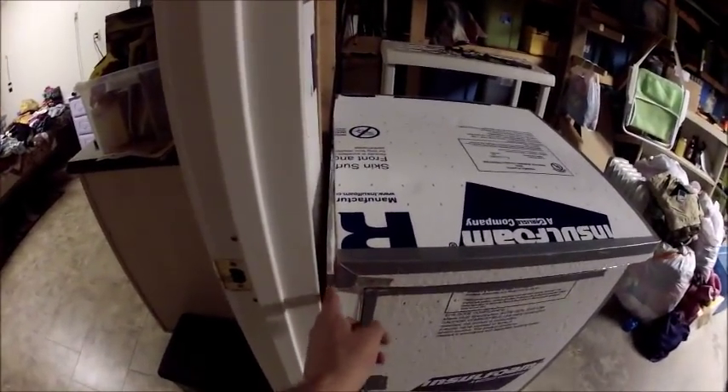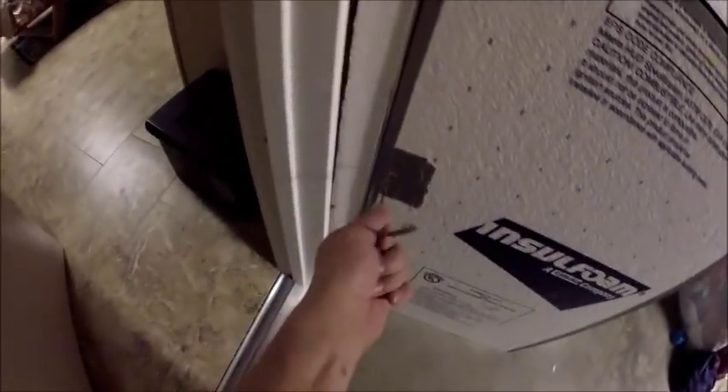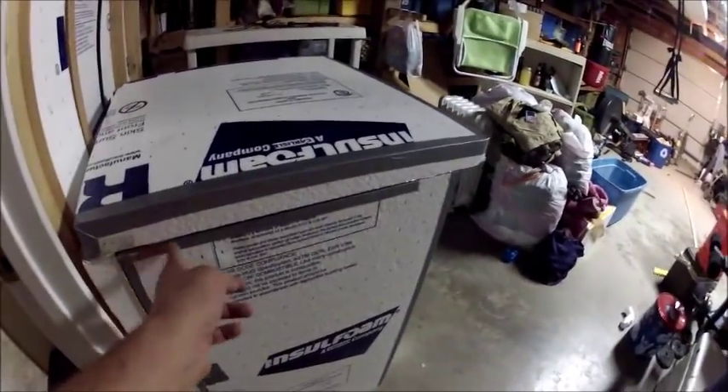Here it is, basically done. I've got two-inch foam all the way around. You can see over here where I mis-measured by a half inch — so measure twice, cut once. That side was 24 and a half in the back and I cut it to 24. It still works and it's still overlapping enough to cover the top, so I'm not worried about it. I took the door and put a rope on it through the old door handle and taped the seam so that was sealed. I taped the leading edges with duct tape so they won't get beat up too badly because this foam is pretty delicate.